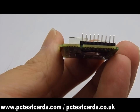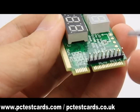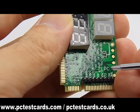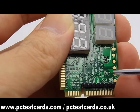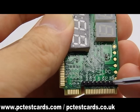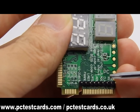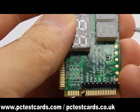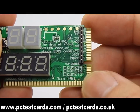There are also 9 pins of connectors here, called the LPC connectors. We can connect a bundle of LPC cables and connect this card to the motherboard chipset pins directly, though some soldering is required. This method is for advanced use, so normally we just use the Wi-Fi mini PCIe connections.